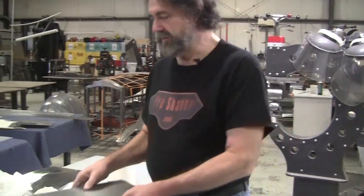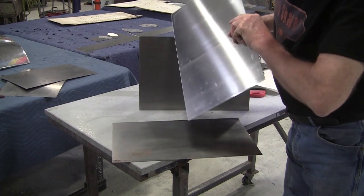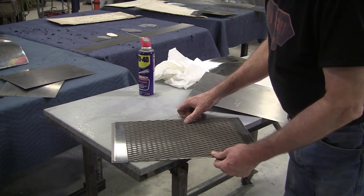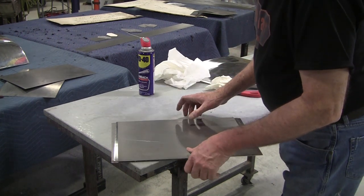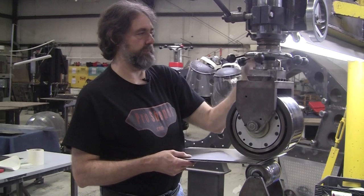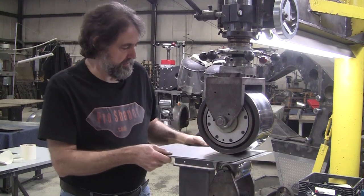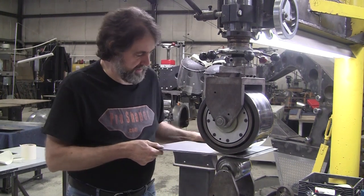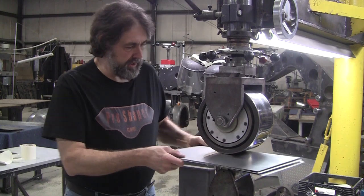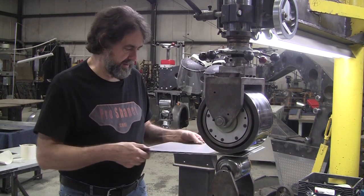Here's another one — this is just simple steel expanded metal. I'll put it on this piece of aluminum. It looks a little better on this side. But if we polish these up, it would be really fancy. Put that sandwich together and loosen this up. This is where the continuous contact of the English wheel is a really nice feature — I don't think you could do this in a power hammer because it's intermittent contact. And it's nice and incremental. You could do it in a press, but it would take a monster press. Here we're doing it one little spot at a time, rolling it.